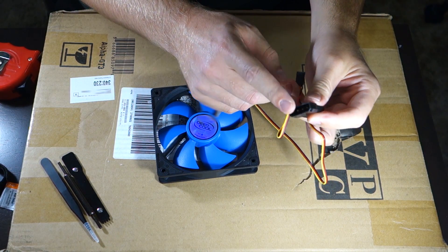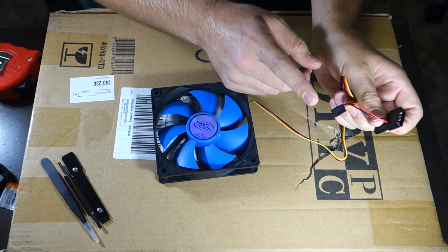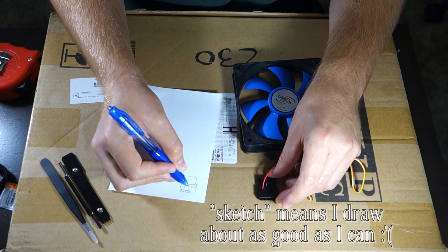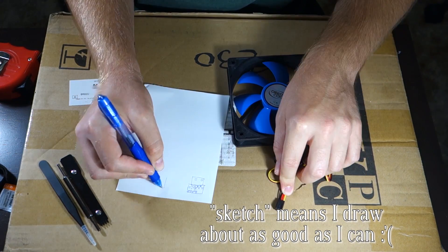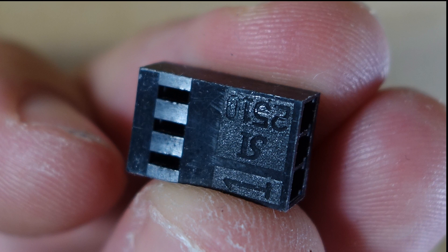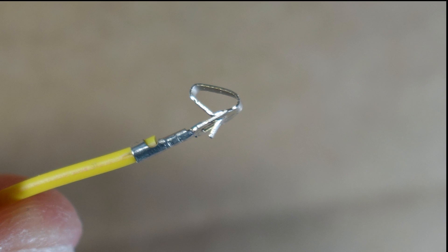The first thing you should do before taking anything apart is to sketch a quick diagram of where all the wires are so that you can remember. If your wires are all the same color, you can use electrical tape to mark them. Now we're going to take apart the 3-pin fan connector. On your screen is a picture of this connector without any wires in it — the three rectangular holes facing the camera are where the wire connectors poke out their little pins to keep the wire from falling out. The next picture is of an individual wire with its connector, and the pin I was talking about is sticking out on the bottom. If you ever need to reference these photos, there will be a link in the description that sends you straight back to this point in the video.